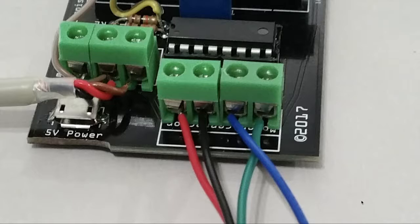Here's a photograph of the wiring for the stepper motors. Starting over by the USB, it goes red, black, blue, green. You'll more than likely have to cut off the end of the terminal block, and I would suggest you strip and tin the wires a little bit — that way when you put them into the screw terminals they will stay more secure. This is going to probably be covered in a shrink wrap type material with a hole cut out, and you start from the USB and go red, black, blue, and green.